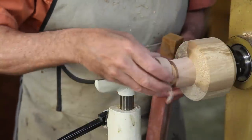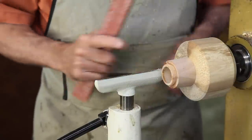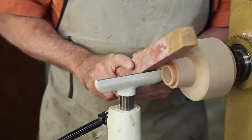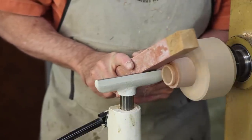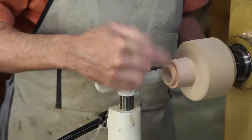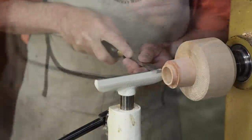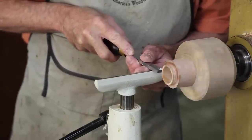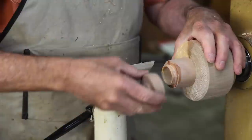As we start to get very close to a fit, our thread is a little too large on this side but it's coming to a sharp crest. So we're going to take it down a little by putting a piece of sandpaper glued to a square of wood against it from the tool rest. This way I can keep the outside crest diameter concentric and take it down a bit more to get a perfect fit. There, just about down to a perfect fit.